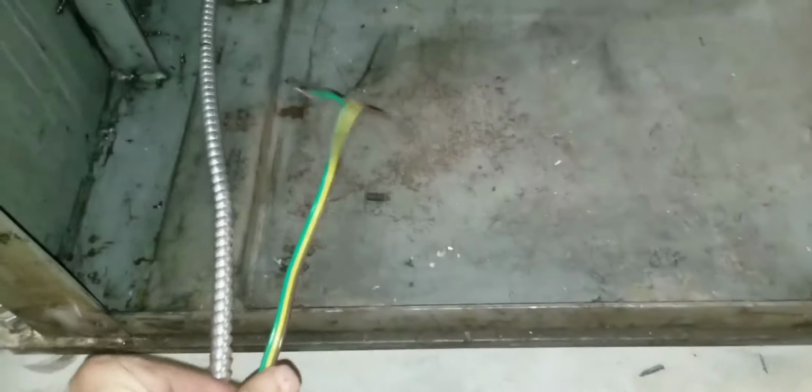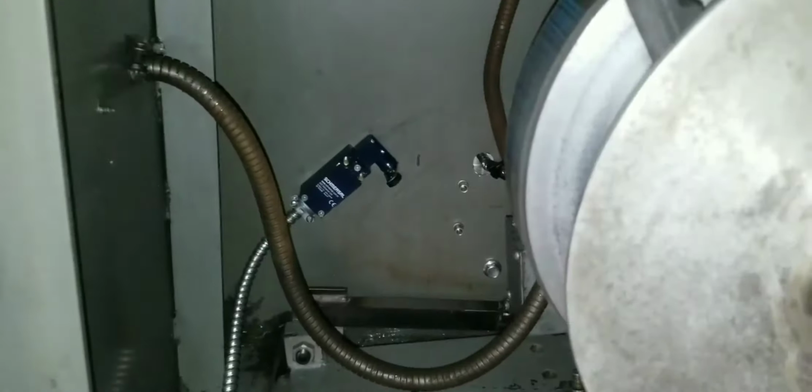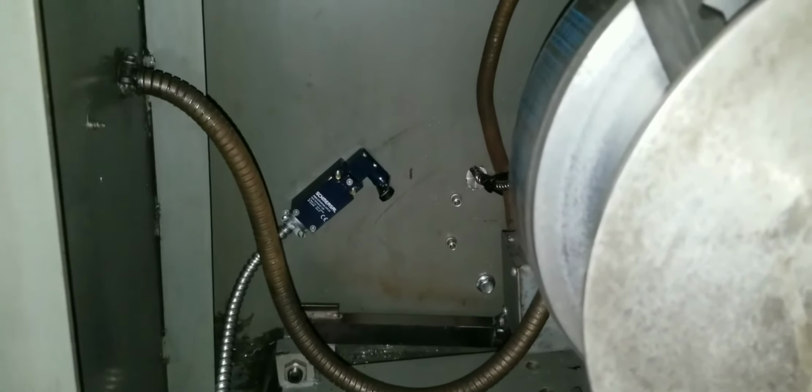It's kind of funny. What I used for wire for this was trailer plug wire. I was looking in my cabinet for some wire, and I seen this. I was like, hey, that's got all the wire I need. It's got a ground, and it's got the in wire and then the out wire. And of course, if the yellow or brown wire gets broke, that's what'll shut the motor off. So it passes through that switch, and when that switch disconnects, it shuts the motor off.